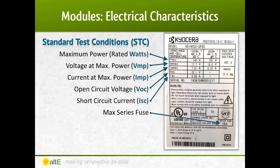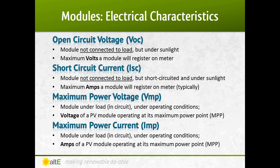Let's go over the specs of the solar module. Open circuit voltage is the voltage you will measure when nothing but a voltmeter is connected to the solar panel. This is the highest voltage the module will output at 77 degrees Fahrenheit with sunlight intensity at 1,000 watts per square meter — just a few of the details of the standard test conditions, or STC. The voltage will be higher when it's colder out and lower when it's hotter. Short circuit current is the amps output with no load on the panel; it is the highest current possible at STC. There are times when the output could be higher — for instance, when the sun is coming out from behind a cloud and you see that silver lining, where the edge of the cloud is magnifying the sunlight, causing the intensity to be brighter than STC.